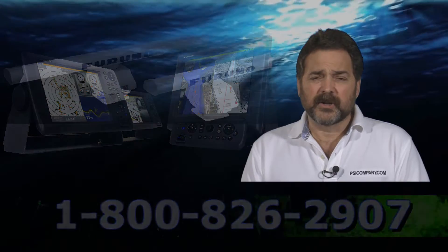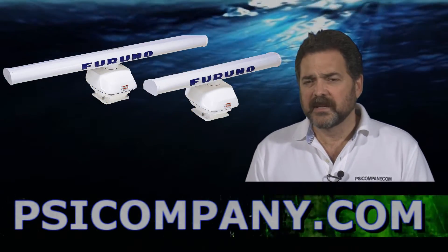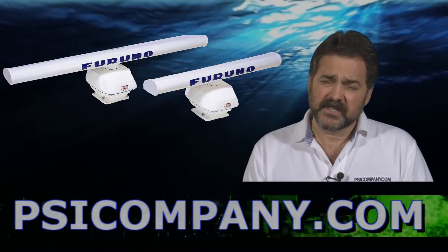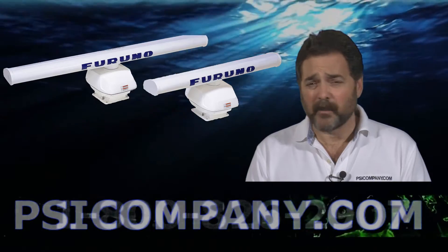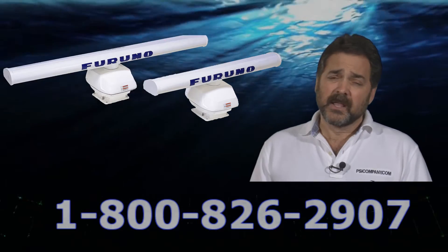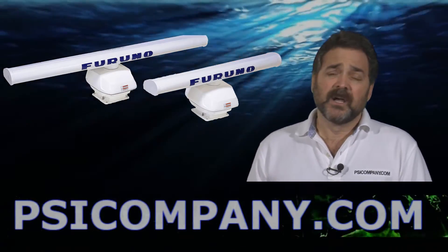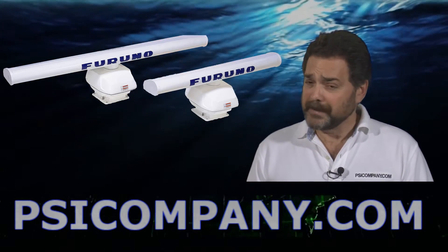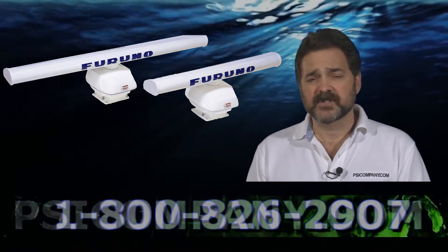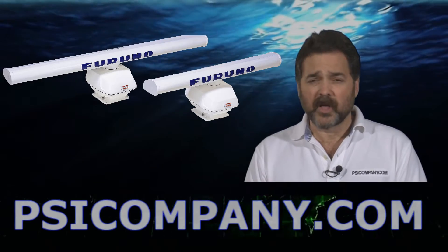Along with this radar, you'll want to consider a couple of things as you're going forward in your planning. The DRS-12A incorporates technology that allows you to use other Furuno sensors in the vicinity of the radar antenna without porting the information back down to the display itself. You can run the Furuno WS200 wind sensor, the Furuno SC300 GPS compass sensor, or the Furuno GP330B GPS sensor right through the radar above decks and save yourself the time and trouble of running additional wires through your vessel — a real help in an installation.